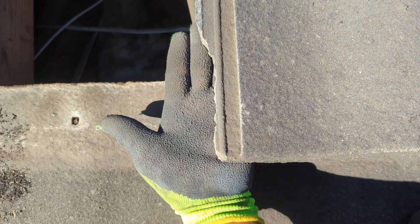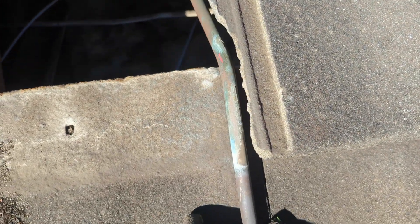We're going to go back to first principles for this repair. Number one: if the water course wasn't broken, we won't have a leak. So the purpose of this repair is to put something in there to duplicate the broken water course. The other thing we've got here is copper, so if there's any steel material in contact with the copper, it's going to cause the steel to corrode and long term the steel will just rust and we're back to the same problem.